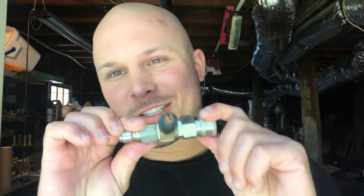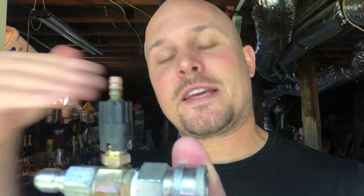Right here is my chemical injector that I currently have on my truck. This little black piece right here is an adjuster for flow. Normally I do not like adjustable injectors mainly because there's a lot of corrosive chemical running through this all the time, and I just don't like more moving pieces than need be. Usually I like a static chemical injector — it just literally sucks chemical through it — and that's how we spray chemical at a ratio onto the house or substrate.